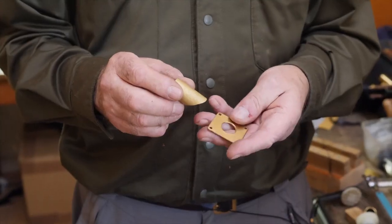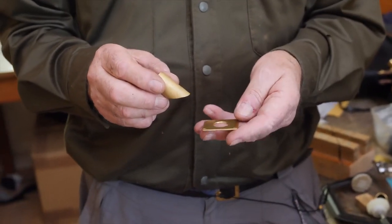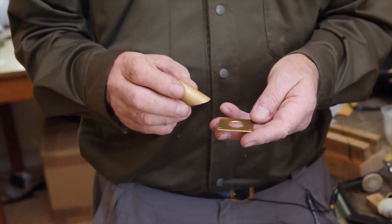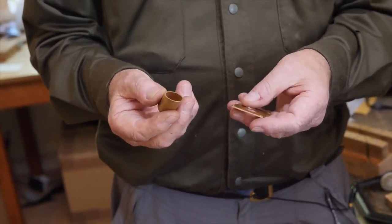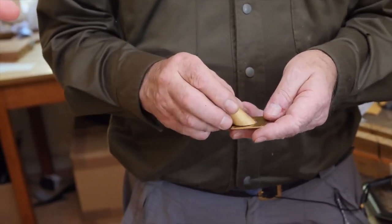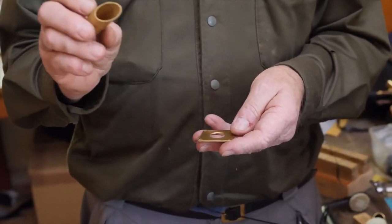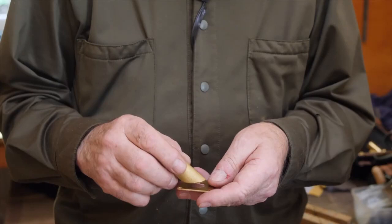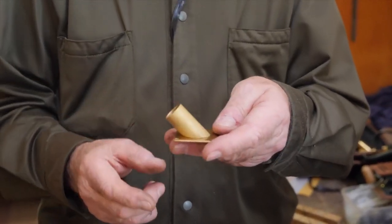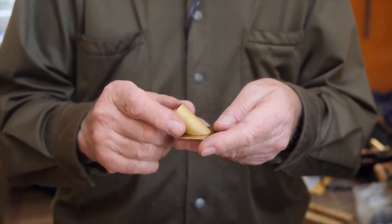Yeah. Now you've got the base plate and your tube tidied up. You take that back to the garage where you've got your blowtorch. The angle on the tube is what? 45 degrees. And at 45 degrees, do you need to wire it together to silver solder? It just sits nicely just by itself like that.